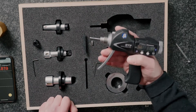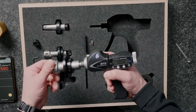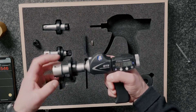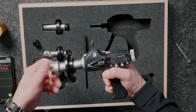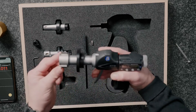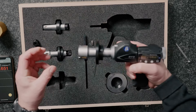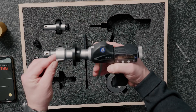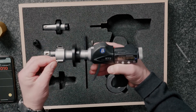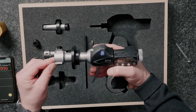The difference with the groove head set is the profile of the anvils. The anvil profile has been stepped down to allow access into an entry diameter, and then to allow the anvils to come into the groove at full depth to measure the groove diameter.